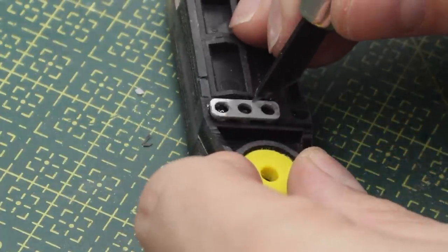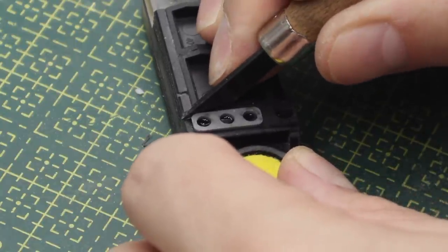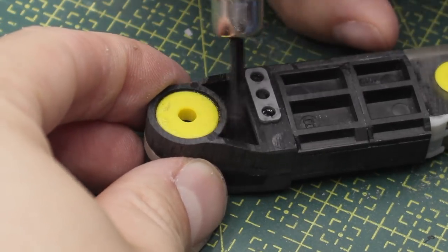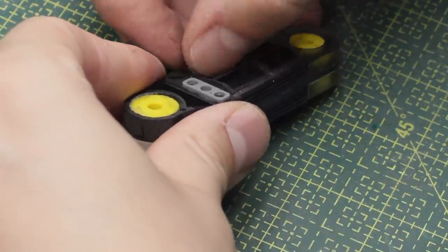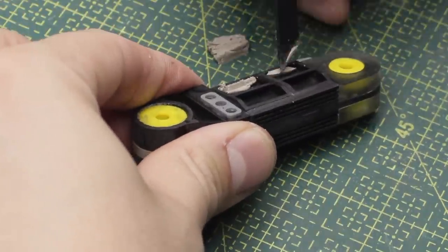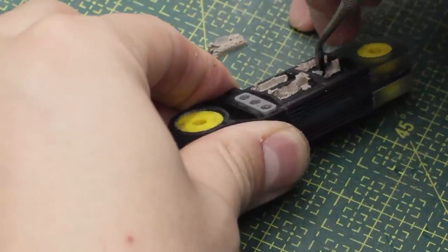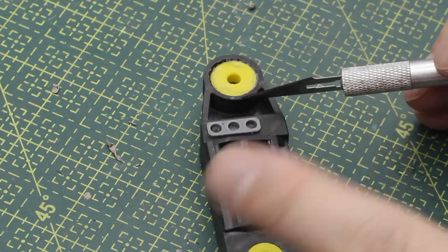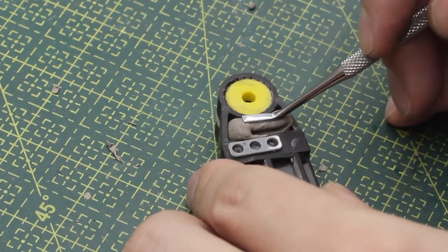At this point I'm also going to add some details to the leg piece. This is going to reach its final shape before I make a rubber mold out of it, so I really have to add the details right now. Those black pieces look amazing, but they have some features that are actually hard to make on a rubber mold. So I have to add some epoxy putty to make the angles a bit easier. I want to make my life easier when it comes to making a rubber mold. I've mixed a bit of epoxy putty and I'm trying to make the angles easier for the rubber mold. I also feel like this one feature is too deep, so I want to make it shallower by filling most of it with epoxy putty as well.